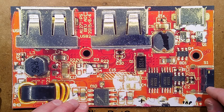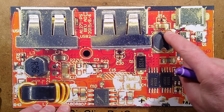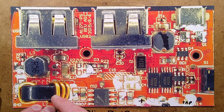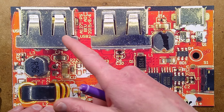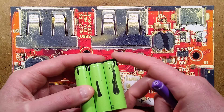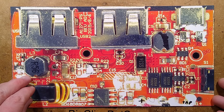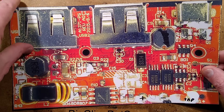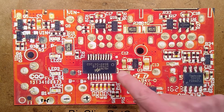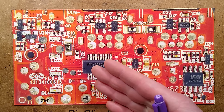Initially it doesn't look too complicated. There's a little boost circuit, a protection circuit, an output circuit, and a buck regulator to provide 5 volts from the higher voltage across the cells — because with two cells in series you get a voltage range from about 6 volts up to about 8 volts. I thought it was fairly straightforward, then I turned the circuit board over and it's really not simple at all — there's something very weird about it. There is a microcontroller, and that's the bit likely to crash and give problems — the bit that needs a reset if this happens to you.